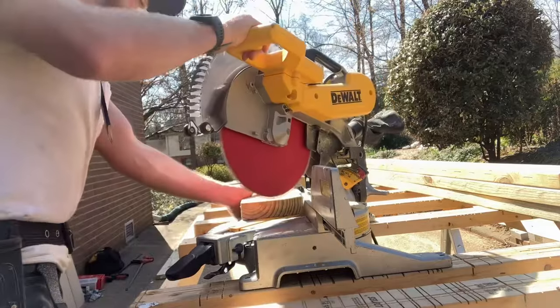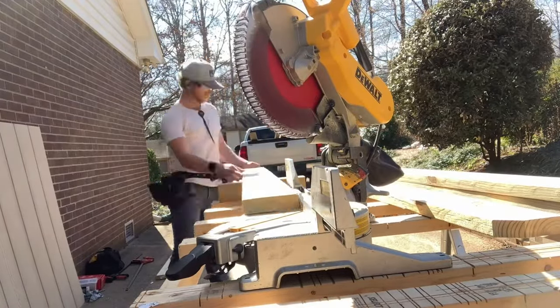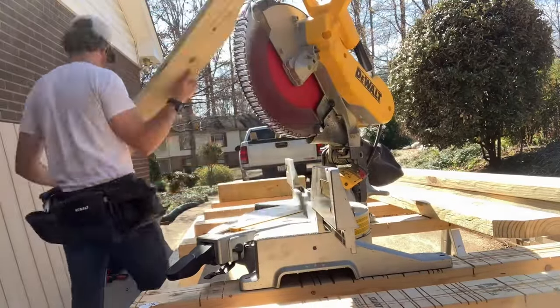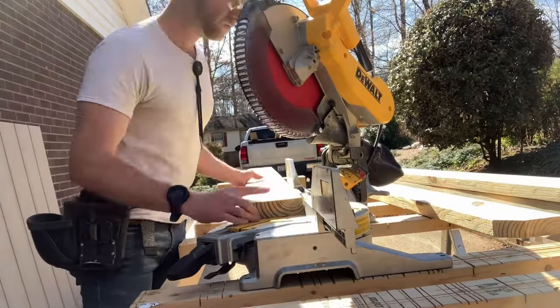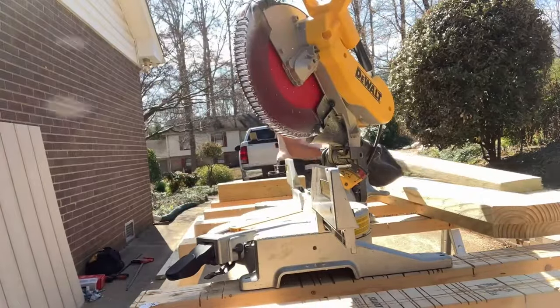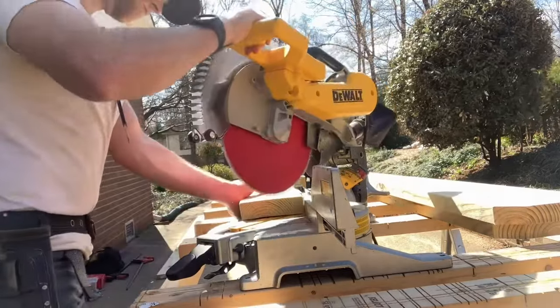The first step in this job is to cut all of your tabletop pieces and bench pieces to 6 feet exactly. Then I go ahead and dog ear the outer edges of the bench seats. When you're doing repeated cuts like this on a project, it's a good idea to make a small pencil mark on your saw. That way you can repeat the cut over and over.